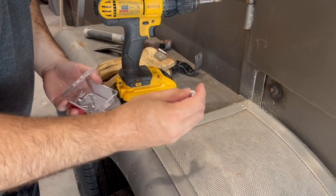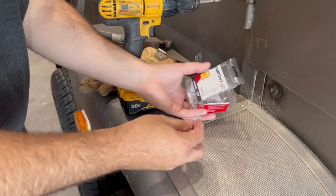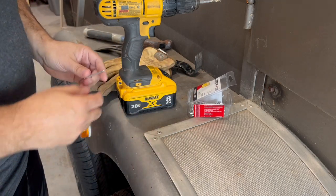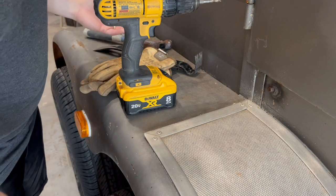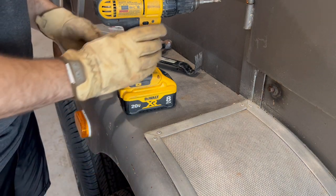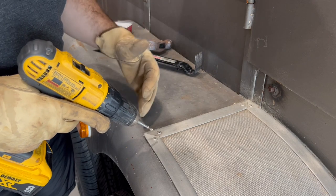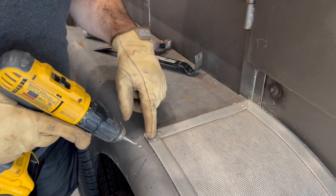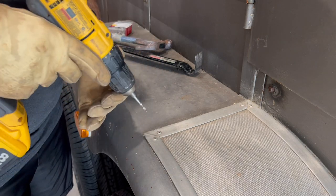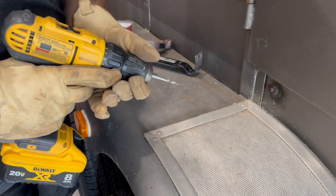These rivets — here's what a new one looks like. A hole is drilled, you put the rivet in, and you use a rivet gun that essentially pulls the inner part up into the rivet, expanding it and holding it in place. So we've got to remove that. It's not like a bolt that you can just unscrew, so we've got to drill it out. Good thing is it's aluminum so it's soft. I'm using a 3/16 bit — I've used a 9/64 bit before and it worked good. All we're wanting to do is drill and disconnect that head from the rest of the rivet so this thing can pop off. Usually it's just a straightforward drill, you don't have to put a lot of pressure on it, and you might have to kind of waller it a bit.